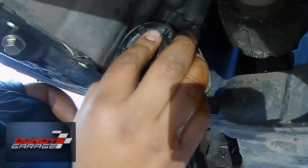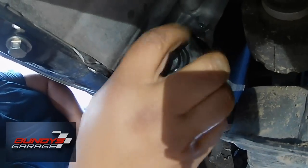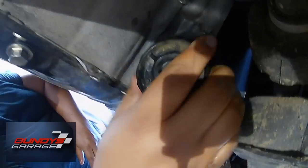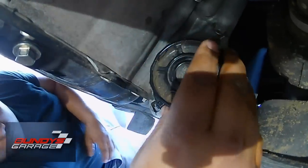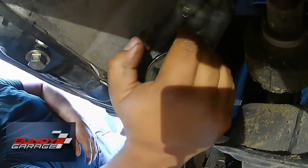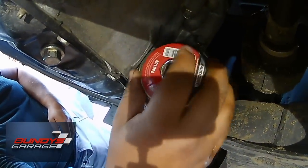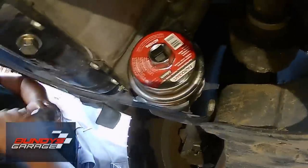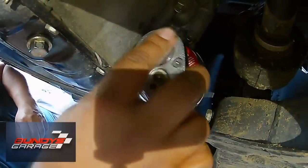Budget Bob took a pair of pliers and cleaned all that out. One problem I had on a regular oil filter was I left the gasket on there — the first time I changed the oil in a little '77 Civic, started it up, and four quarts of oil ended up on my dad's garage floor. I learned my lesson there. Now I check for that O-ring gasket every single time. Don't want to leave the old one on there.